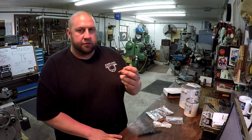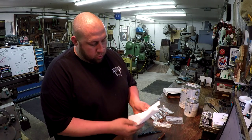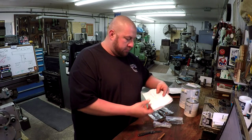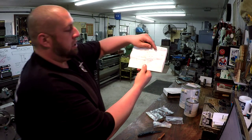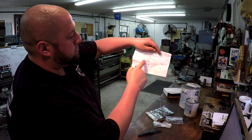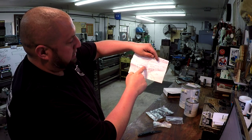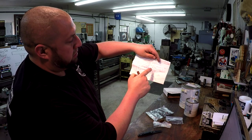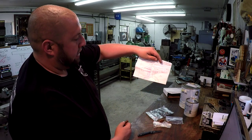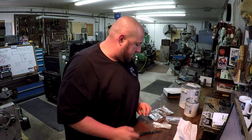And what his idea was for this, he actually made a little sketch on an idea to make the spring mech that goes on the back of the grounding straps a little bit more stout. His idea was to take this bolt and actually machine it. Find a heavier duty spring, machine it like a shoulder bolt, really. So machine it 3/8 here, and then turn and thread this area on this end for quarter 20, and just use that instead of the stainless. So we'll venture into this and see how we can take care of that also.